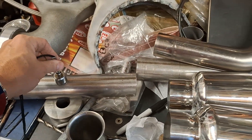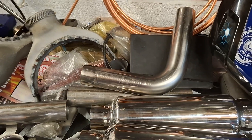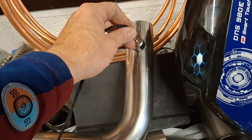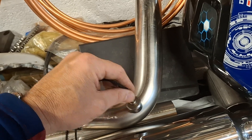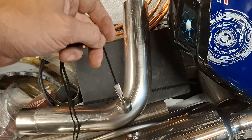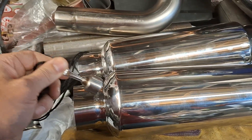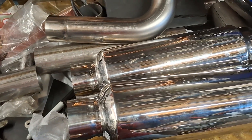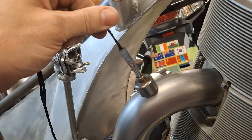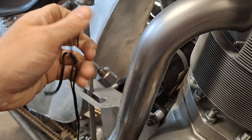I've found something quite interesting — this is a stainless steel bend; it's not magnetic, but when you put the magnet on the bent part of it, it's slightly magnetic. See that? It's ever so slightly magnetic there, and it's the same for any piece of stainless that's been bent or stressed in some way — it's always got a bit of magnetism left in it. That applies to the piece on the bike too: not magnetic at the bottom, slightly magnetic at the top.